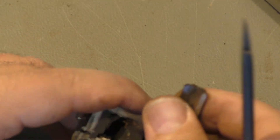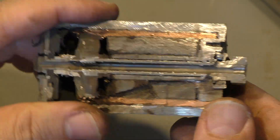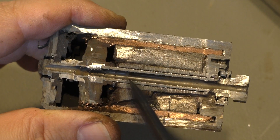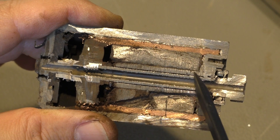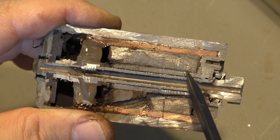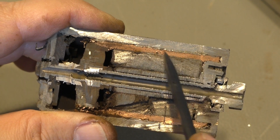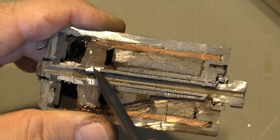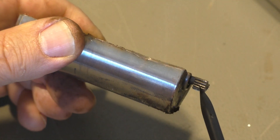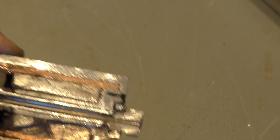So that's how this ironless motor works. The axle is here in the center; here is the holding piece screwed in with the magnet — that part is glued on so the magnet doesn't turn. What turns is this copper tube together with the axle, ball bearing, ball bearing, and output gear. Pretty amazing — thanks for watching.